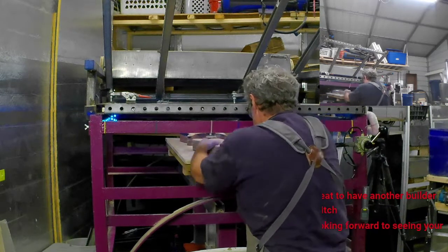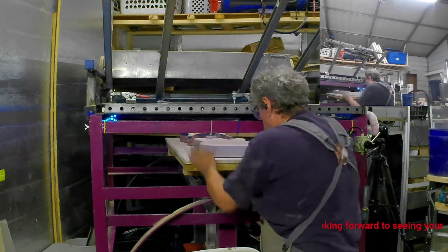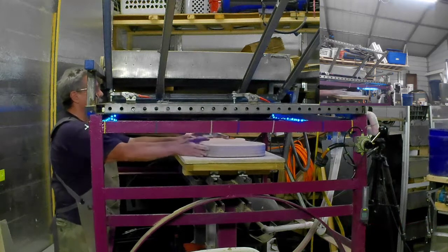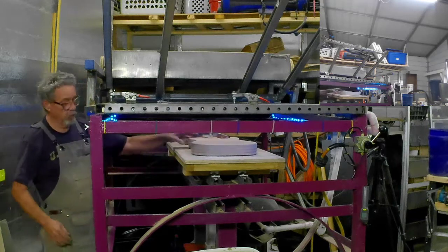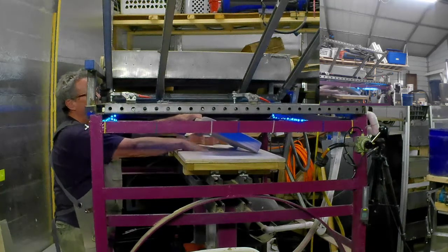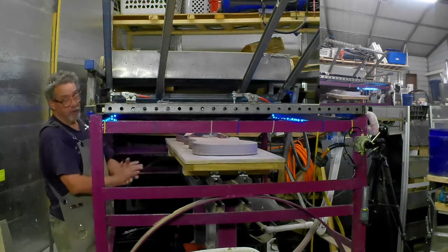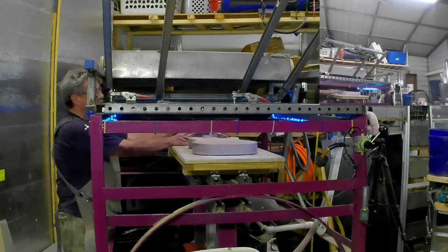Well, let me turn these tapers to the inside where the heat's going to be the best, and it'll make better parts that way. So we're going to put one right there, okay? And we got to put the other one down this way a little bit. And we're going to bring this one up on top of the air hole so the air hole don't get plugged. Now, the way this works, guys, if y'all can see here, there's a hole right here where the vacuum comes. It's going to pull a vacuum, and I'm going to have this up off of the bottom so the air can pull around it and suck the plastic. And the same air should get over here and pull this one, too, if everything goes well, is what we're hoping, okay? I'm hoping it gets enough vacuum to do them both.